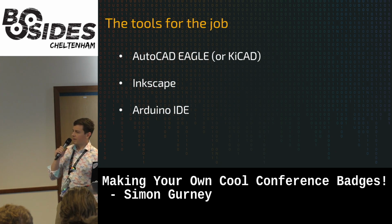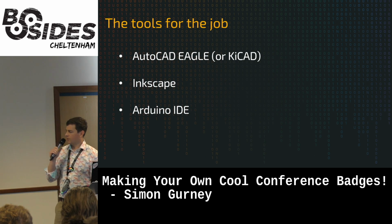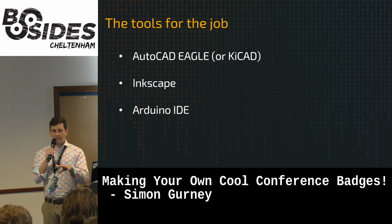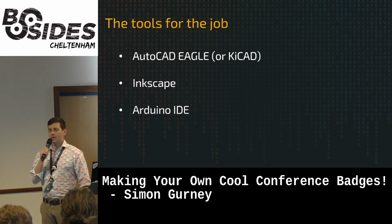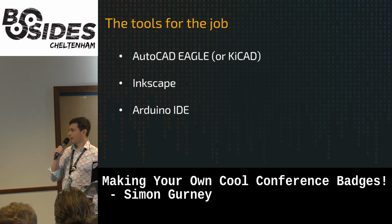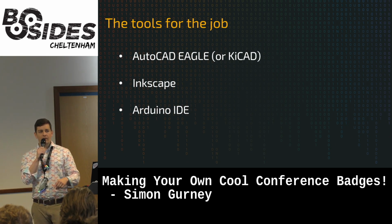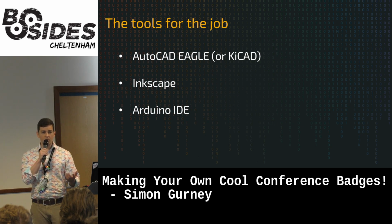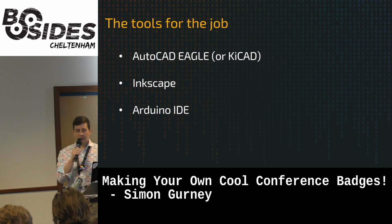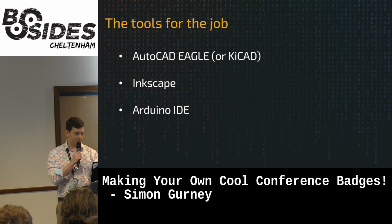Inkscape is a vector tool, sort of like Adobe Illustrator. Some of the guides you'll find for using Eagle will be to take an image off the internet and bring it in from a bitmap format, like a JPEG or a PNG. You're going to find a lot of pain doing that, so I wouldn't recommend it. So what we do is we can go via Inkscape and turn that into a vector, which, if everyone knows vector images, they're a series of lines and dots and arcs and things, which is much easier to work with than a pixel representation of an image. And then coding, I use Arduino because I'm not very good.